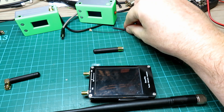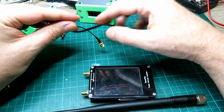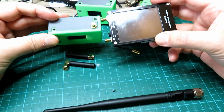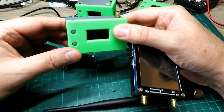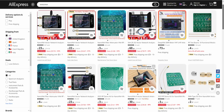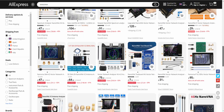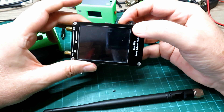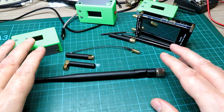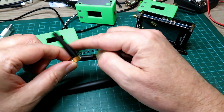That is what I was mainly making this video for — a few people, including myself, had been having poor performance and didn't realize what was going on until I checked all these antennas. The best thing you can do is, when you buy a Meshtastic node, buy the Nano VNA at the same time. These are really inexpensive — about 30 quid from AliExpress. You can set up a configuration for your antennas and it loads in as soon as you power it on. Don't buy one of these and get disappointed because your absolutely terrible antenna is the problem.